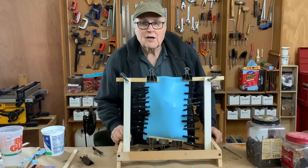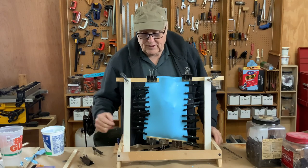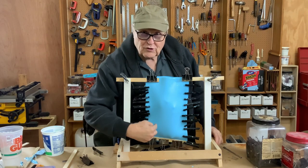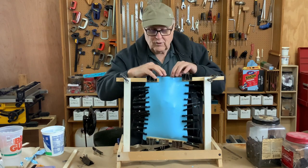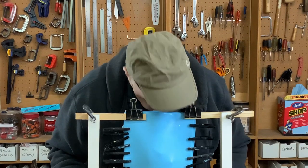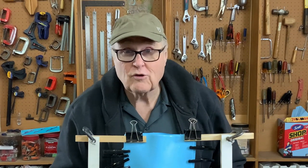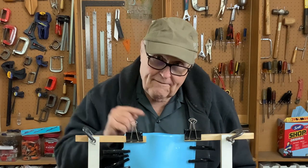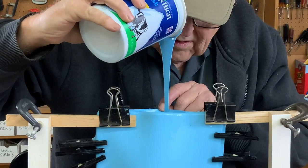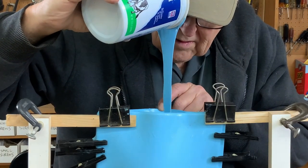Let's hope it doesn't leak. I let this sit overnight because I wanted to make sure the rubber was cured up — didn't want this bag to leak when I pour it full of rubber. Looking down in there, it looks pretty good. I don't see any light leaks, so that's a good sign. Let's mix some rubber and fill this sack up. The downside to this mold is that I'm pouring blind.